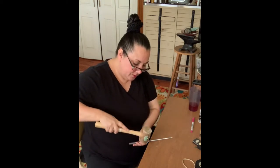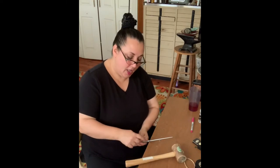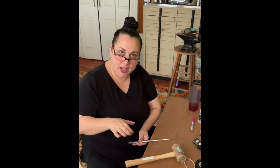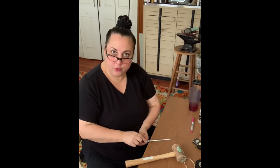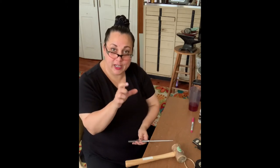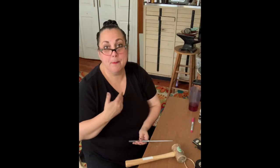You're gonna hit downward like that. That way when you hit this, it's actually getting hit in the back as well. The force is kind of getting distributed and it's driving the bezel or the ring shank down all the way around. So instead of whacking it in one spot and thinning that spot, you're getting the whole bottom to stretch a little bit, which is what you really want. It's much more efficient.